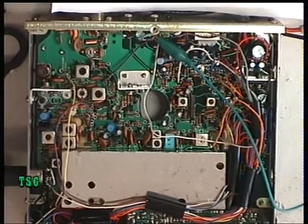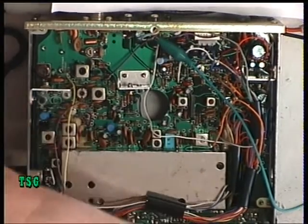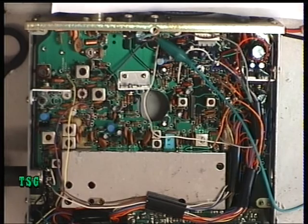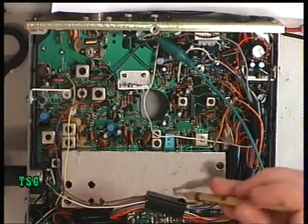So now we'll move on to setting up the deviation. I'll get the little oscillator out. It's quite low actually — it should be a maximum of 2.5, so looking at 2.2 to 2.5, and it's actually starting to make me wonder whether there's a fault, it's that low — it's 1.5. So we'll see whether that will adjust, and the deviation is through the screening can here.